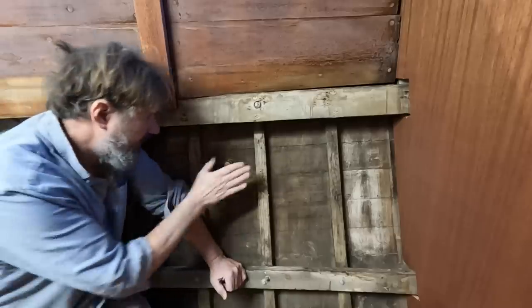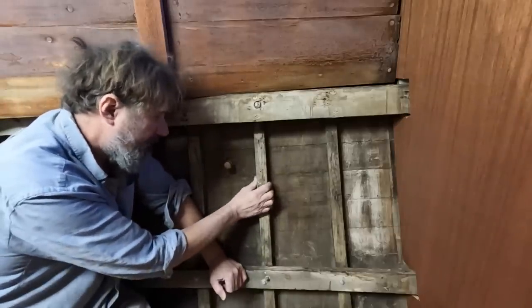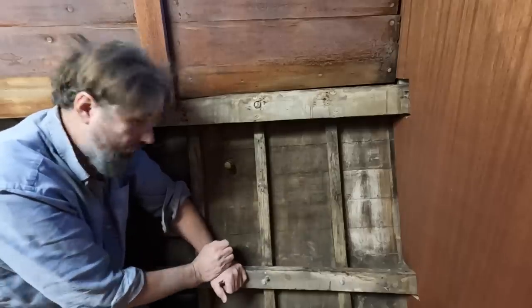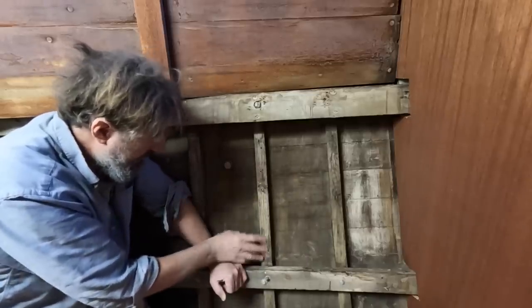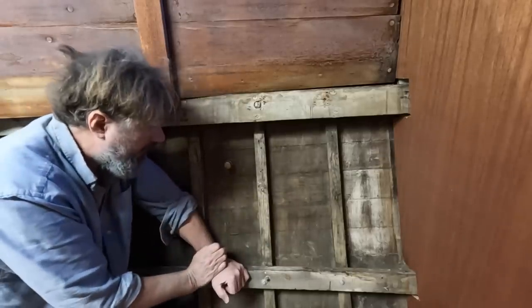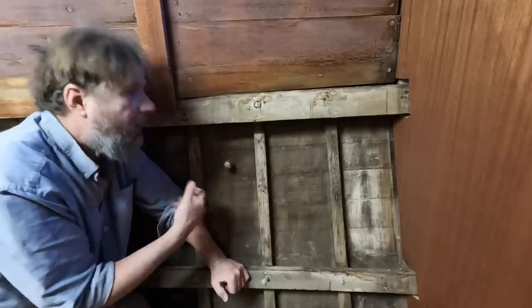Alright, so ceiling. Ceiling is paneling the inside of the frames. I guess the word comes from sealing it in. I don't really know. It certainly doesn't mean the surface that's above your head on a boat. So this boat originally had ceilings. I can tell by all the tiny little steel nails that were in here at one time. And to me, ceiling does two things. One, of course, it's aesthetic.